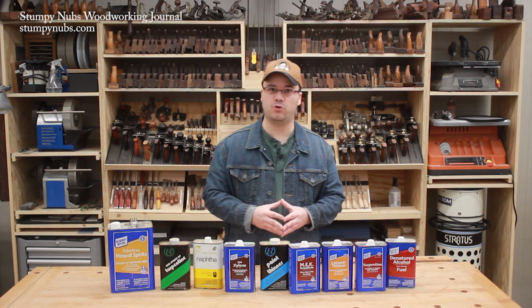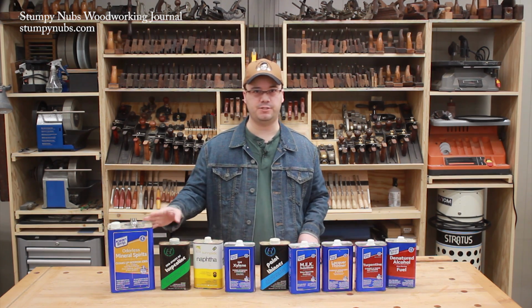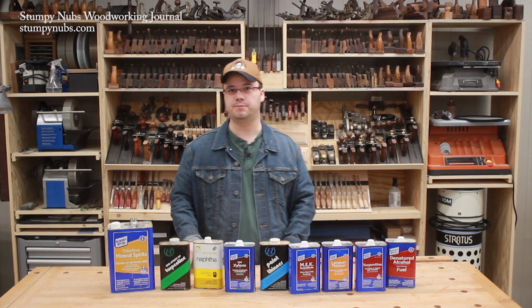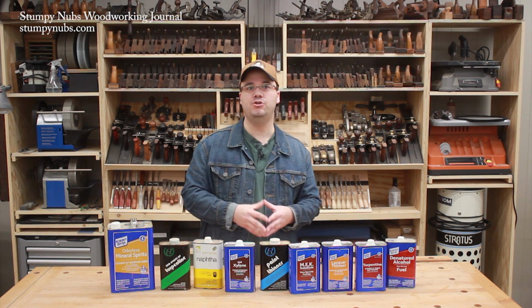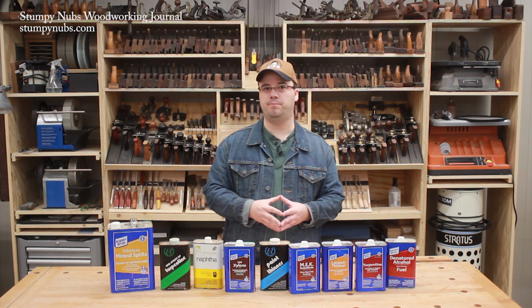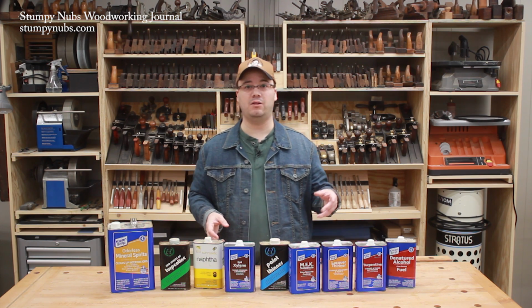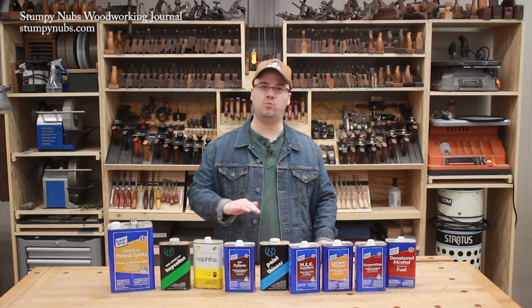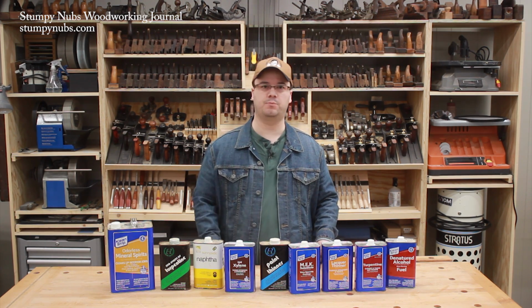For thinning finishes or cleaning up afterwards, you can usually use mineral spirits for oil-based finishes, alcohol for shellac, and good quality lacquer thinner for spray lacquers. If you wish to experiment with drying times, you can substitute one of the other solvents for mineral spirits, but that's the subject of another tutorial. I wouldn't worry about keeping acetone or MEK or toluene on hand unless a specific task calls for it. And always well ventilate the area when using any solvent and wear a proper respirator.